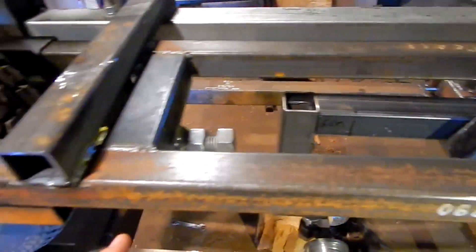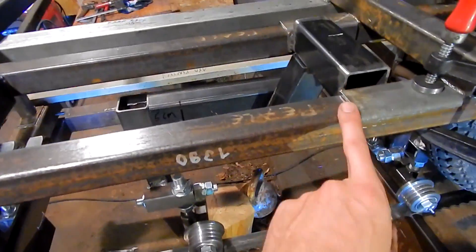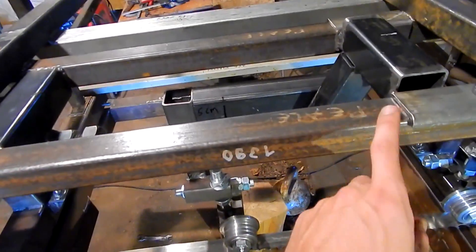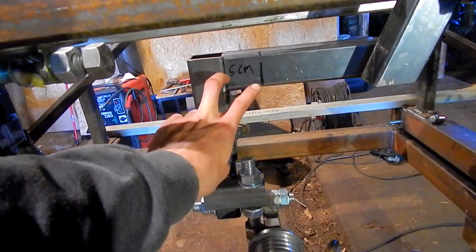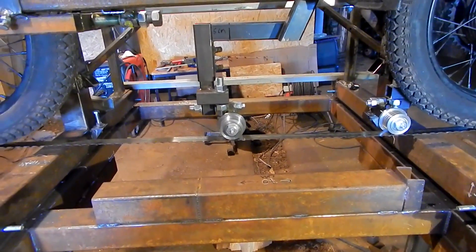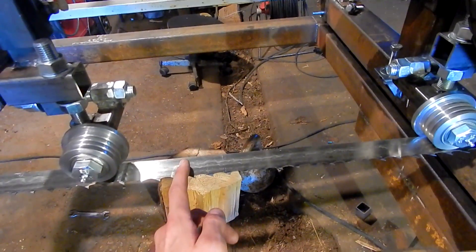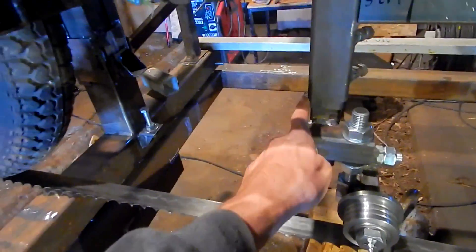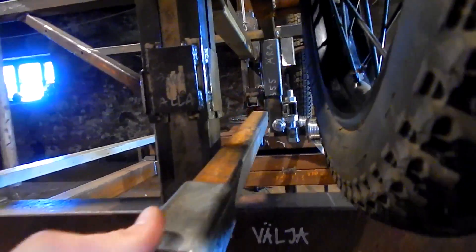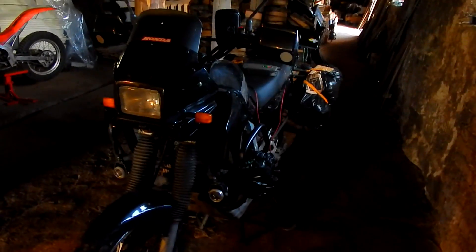So far the full width of the cut will be 35 centimeters right now, and the movement of this blade guide is 38 centimeters. But I'm gonna cut and shorten this part by 5 centimeters — I think it's enough, maybe even overkill. It has to come closer than it is right now, so right about here, and it will have a third mounting point with a slider here.